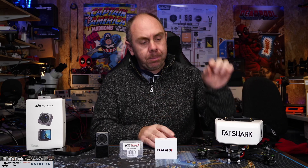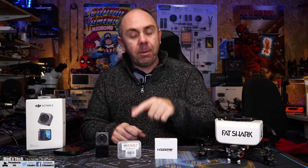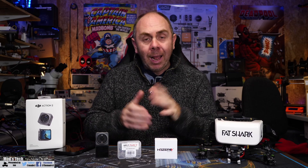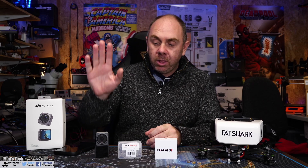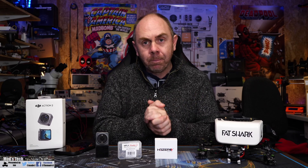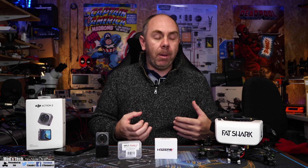The beep on the GPS Mate isn't the loudest, but ViFly also make the Finder 2, which is a much louder beeping version. While it doesn't have the GPS power feature, it does have a built-in battery. I've fitted these on all my other quads because I almost lost one the other day — it crashed with a lipo failure, went flat, and the main motor beeper died too. Whether you want GPS pre-lock or just a reliable beeper, ViFly have nice little modules to help get your aircraft back and make operating easier.